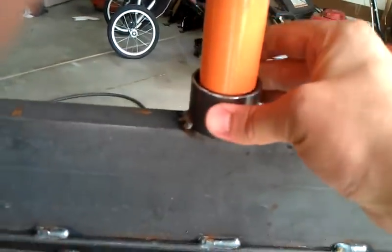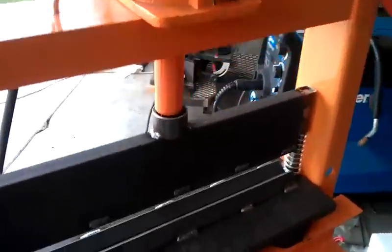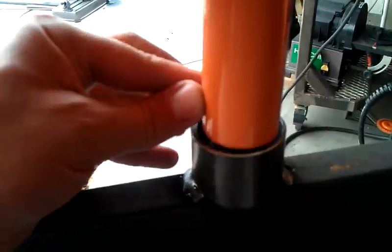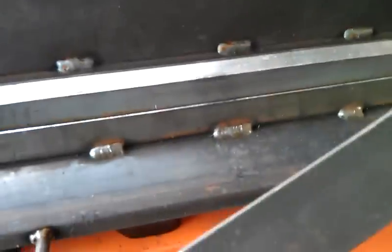I did put a little cup down here to receive the ram, and inside that cup, because I have a short stroke on the ram, there's actually about a 1 inch piece of steel in there to make up the difference. I'm going to go ahead and bend something — it's only a 1.5 inch by 1.25 inch bar stock. I know that's not that impressive, but let's see what we can do.